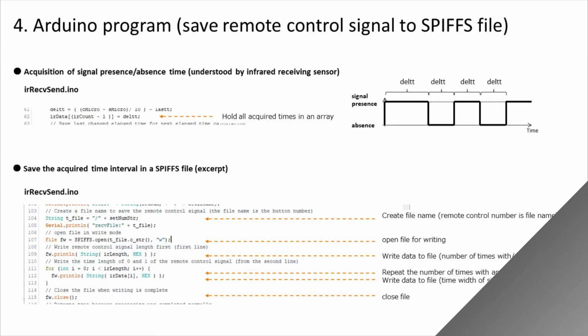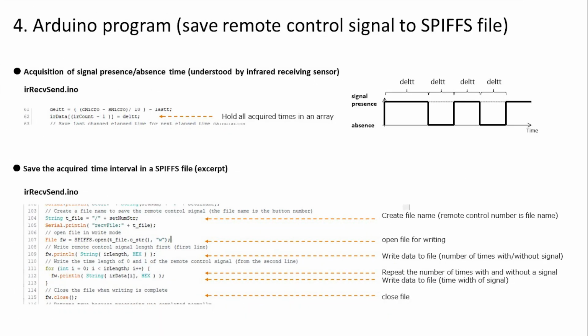Move on. As for the Arduino program, we have understood remote control transmission/reception, web server functions, etc. by the 5th part, so let's understand the newly added contents this time. The added part this time is that the remote control signal is saved in a file, and the button name is saved in EEPROM. I would like to understand the contents.